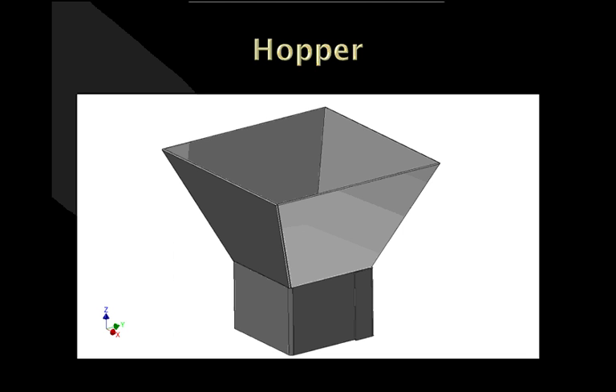With this, of course, it would definitely be easier to start off with a single part, but then we have to break this up into the separate parts for fabrication afterwards. I'm going to show you how to do this in Inventor using multi-body solids.